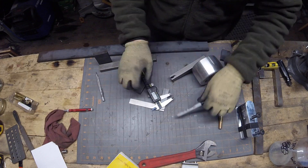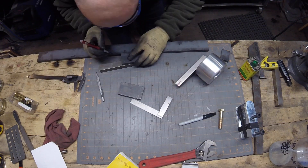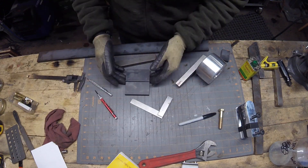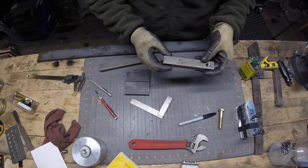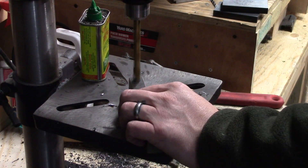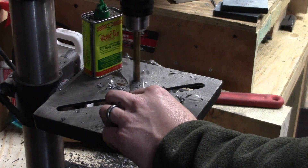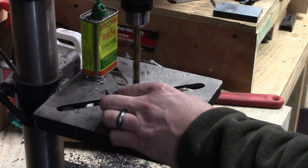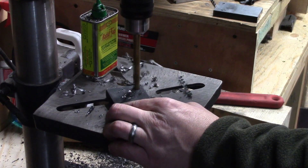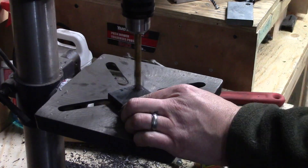The way this whole thing works is that on the tracking wheel I've got a bar - a piece of one inch by three-quarter inch bar stock - and it's going to sandwich between two plates that are half inch by two inch, as well as a half inch by two inch plate that the whole thing will rest on. At the far end of the bar, which is the end I'm drilling right now, that is the pivot hole. I'm using a three-eighths bolt for that, and those holes go into the side plates as well, creating a pivot point for our tracking mechanism.